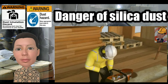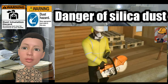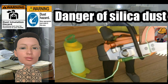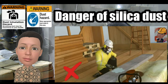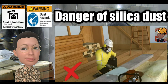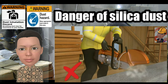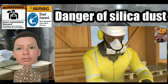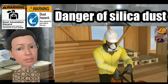To reduce dust exposure when using cut-off machines, do the following. Use the purpose-built water suppression system. Don't use a bottle of water to wet the surface of the material beforehand — it is ineffective, as the surface needs to be continually wetted throughout the task. And again, wear a respirator that's been fitted to your face and is of FFP3 standard.